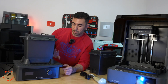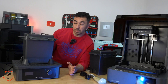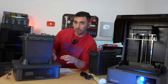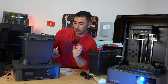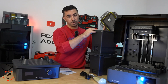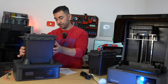The washing station is done. This one is a bit different from other washing stations — you put it in like this and it turns and makes a splashing motion with the alcohol to clean everything. I haven't seen anything like this. I was a bit worried about whether small parts would break during splashing, but we'll see. After cleaning, you place it over the second bucket and open the valve, which drains all the alcohol into the second bucket. What's left is only the 3D printed part — no contact with alcohol at all. That valve presses when the top bucket is placed on it. Really smart idea.